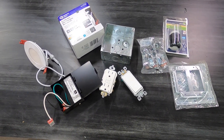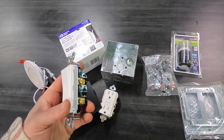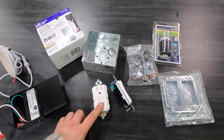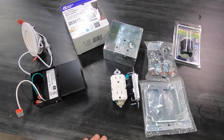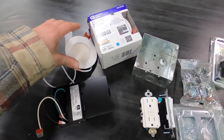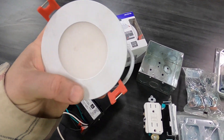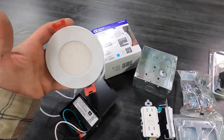I have a few electrical upgrades I'm going to do. Right now I'm just plugging it into the wall, so I need some kind of switch on the side to turn the pump on and off, and also one for the lights — I'm probably going to put a tandem switch in. I'm also going to put a GFCI outlet in the side of a four-square box so I can plug the pump in, then run a cord to the wall. I have these low-voltage LED lights that are wet rated, and I'm going to put them on the outside so only the disc area with the light is inside the cabinet.